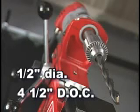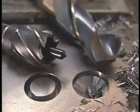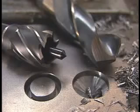With the chuck adapter accessory, it can drill a one-half inch hole four-and-a-half inches deep. The 4270 has the biggest capacity in its class. Annular cutters drill faster than conventional twist bits because they remove only the outer edge of the hole — the result is a faster cut and a burr-free finish.